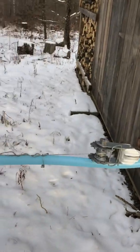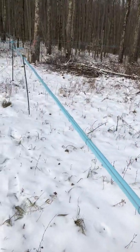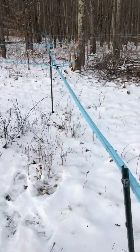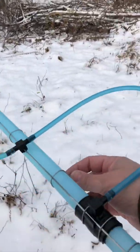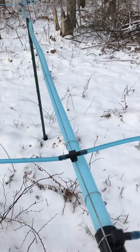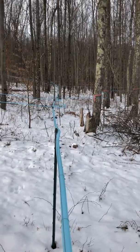It's the wire tensioner — you just turn this thing and it tightens the wire up. I got it pretty tight. Then we ran the 3/4" main line underneath the wire, unrolled it and pulled it out through the woods. Then you hook your main line with these twist wires and a little tool that twists them on every 12 to 18 inches. Once you have this secure, I went through and put posts under mine to keep it rigid all the way out through, so I have a consistent drop.